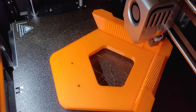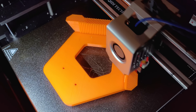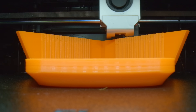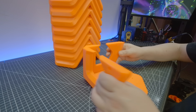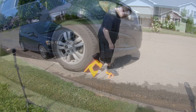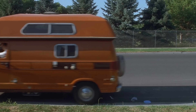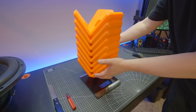I'm going to make this thing run for the next 288 hours with the nozzle at 240 degrees as I print 8 of these 36-hour PETG corners — 0.2mm per layer, 40% grid pattern infill, and 6 perimeters all the way around. These are going to be absurdly tough. All but one, which failed on account of a power outage — and while it does have some extra give, it'll still take more before it shatters. The fully formed corners add up to 5.6 kilos, which breaks down to about three-quarters of a spool per print.